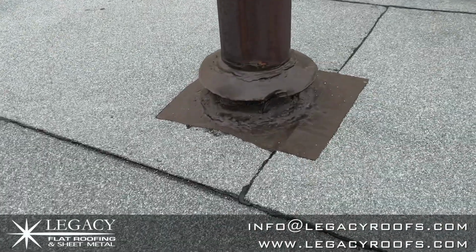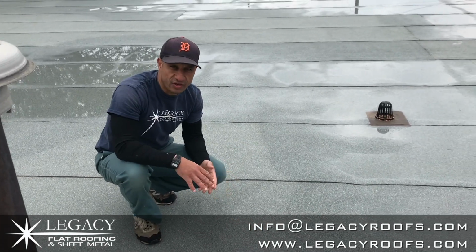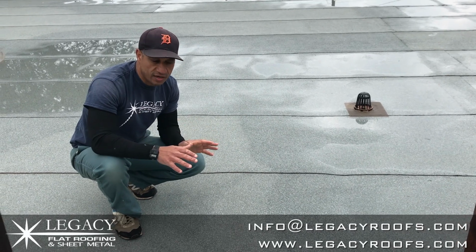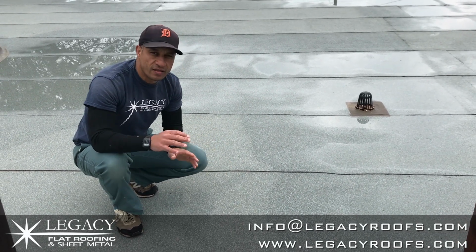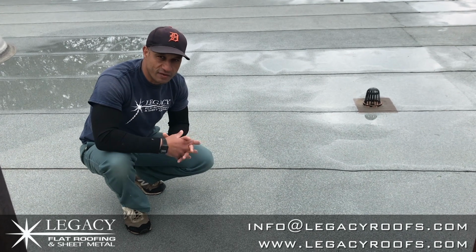We also had, when we started this job, I don't know if you remember, 2 sleepers which held an HVAC unit. So it's just 4x4 blocking that held an HVAC unit. It was redundant, wasn't being used, we took it out. The fewer penetrations you have through your roof, the better, because typically that's where you're gonna find your leaks.